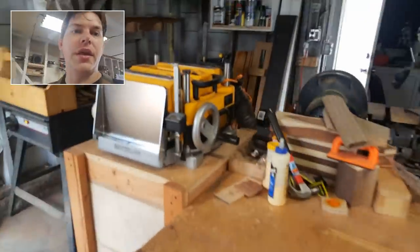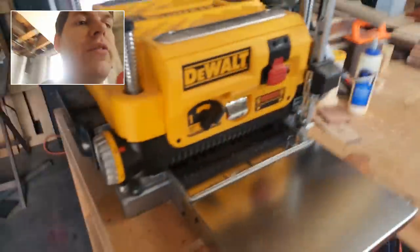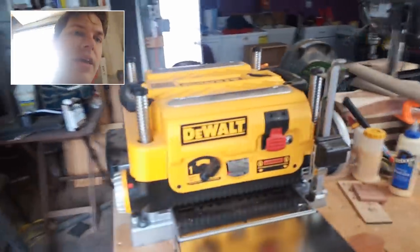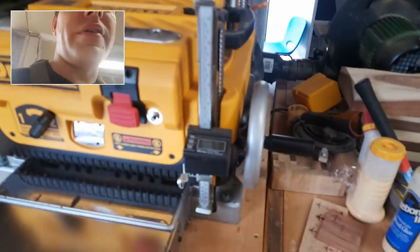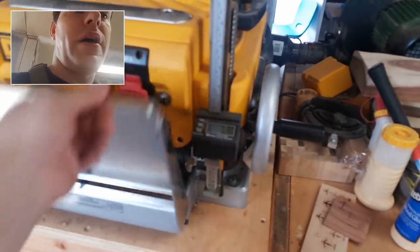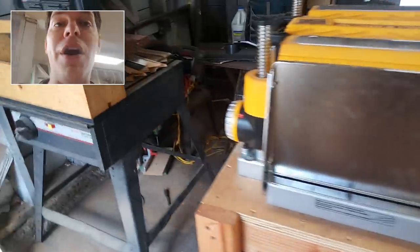Planer. You don't need to get a great planer like this one — I mean, I process a ton of wood. This planer I recently upgraded to a really sexy Helix cutting head, which if you ever want to get nerdy about, we can get nerdy on that. It also has a digital readout so I can tell exactly to two five-hundredths of an inch how thick my stuff is going to be. Very important when you are trying to make perfectly aligned boxes.